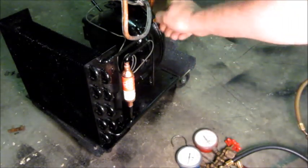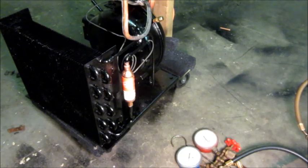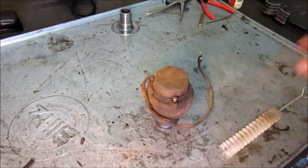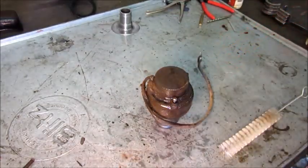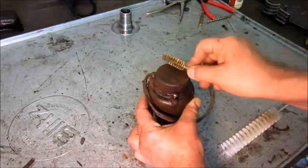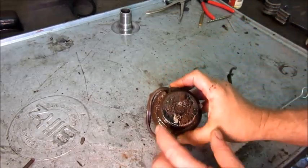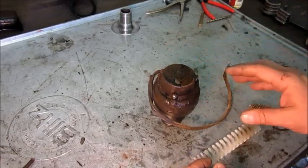At the port with gasket - alright, now to move on with further reassembly. Going to do a little work to this fan motor here, the condenser fan. Start out by hitting it with the brake cleaner on the back and scrub it down to see if we can see any markings under there. Looks like a GE. Keep cleaning that up, going to use the nylon brush to try to get all the oil and stuff off.